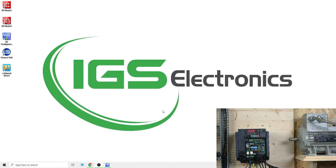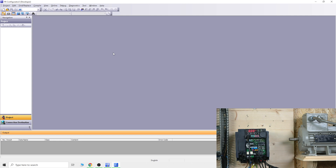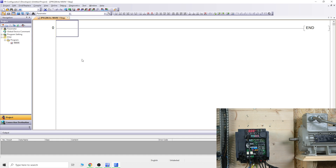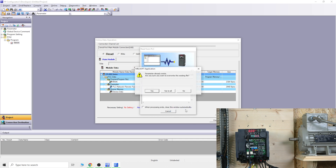In FR Configurator, that's all you need to do. Now let's open Developer — it looks very much like GX Works, though some functions have been removed. Read through the manual as it's very good and explains what is what. First thing: open a project — select the FR E series type. It's a simple project structure. Since I already have a program pre-written to show you how to get started, I'm just going to download it from the PLC part of the drive by selecting Main and PLC.